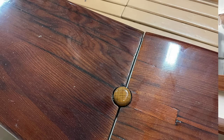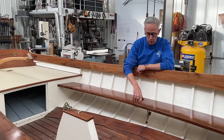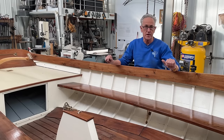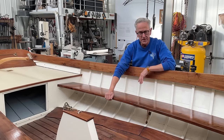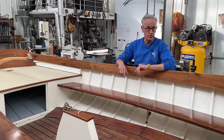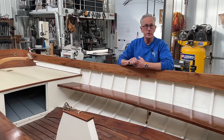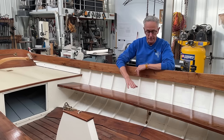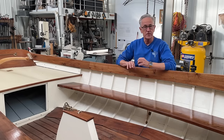It is essentially putting a dowel pin right here in the center of the split seat, and then on the ends it's a half of a dowel pin. So what I'm going to do is make a dowel pin for the center and a half dowel pin on each end, which will secure the piece from sliding back and forth. It's essential that you'll still be able to remove the seats easily if you wanted to. I'm going to use walnut since I have walnut seats in the boat, and I think it'll be a nice smooth transition between the seats and that pin.